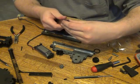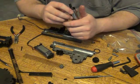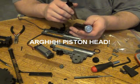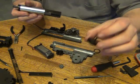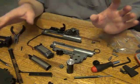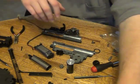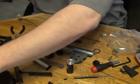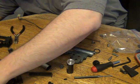It's very tight. So now the gun probably even shoots better FPS with a new cylinder head like this beefy one. It could be less depending on the weight of the piston too, but at least it's beefy and fixed. And before, we would have lost compression regardless right here. So let's go ahead and put that to the side. So we're all set. Let's get some new cylinder grease going in there, because we are done with that. And later on, I will make a video on the other stuff.